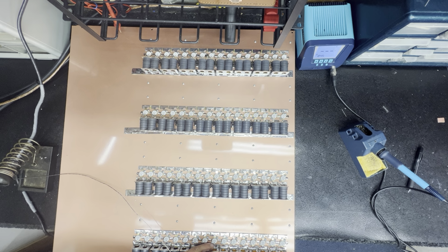Too much stuff. If you look at a 101E on the preselect, on the receive, it's got pistons that go up and down in these little canisters to adjust the preselect, and they're on little bitty wire strings. If you get one of them messed up, you're in deep. It's like a little motor on little bitty wires. It's got four or five pistons, maybe six, down through there, and they run in sequence. One goes up, one goes down, in time. If you ever get one of them messed up, you got problems.